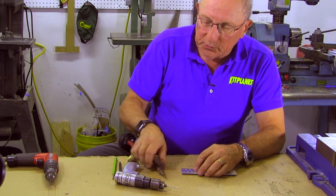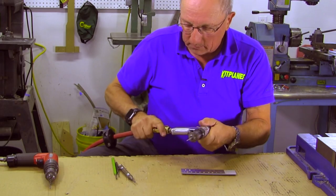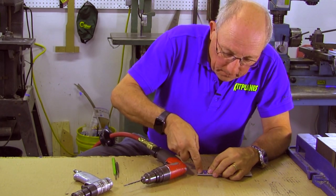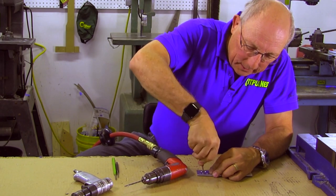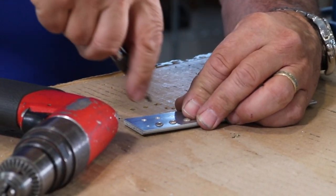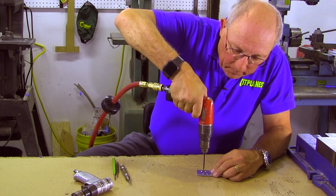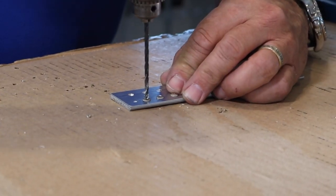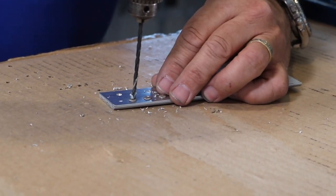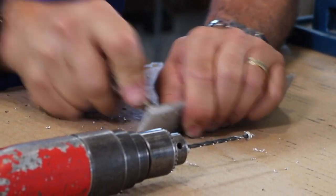Round heads are a little more difficult because when you put that drill on the top, it's going to want to fall off to the side. So you have to be more precise with your steering. We're going to be using the bigger drill — this is a 31. We're going to center punch right on that little dimple that they've already given us, working at it pretty forcefully to make sure that we've got a good starting point. Make sure it's centered up and then a couple of little bursts to get started. Notice I'm doing quite a bit of steering on that drill. There, the head is off, and we can punch the shank and the tail out with our center punch.